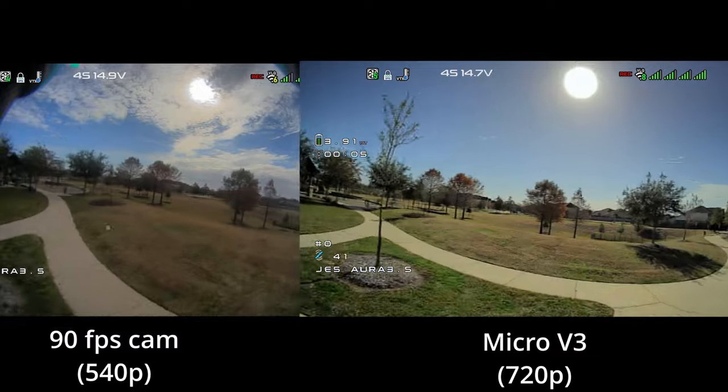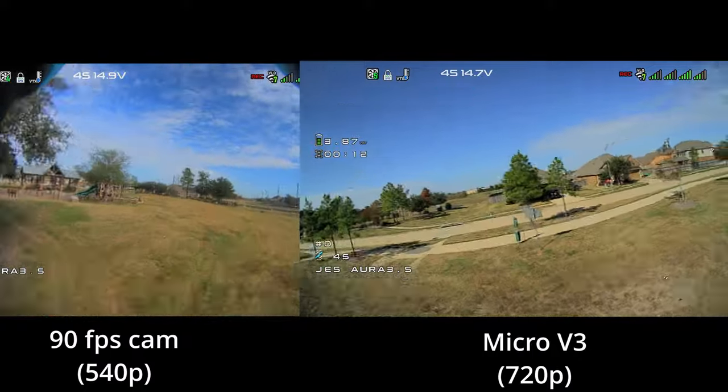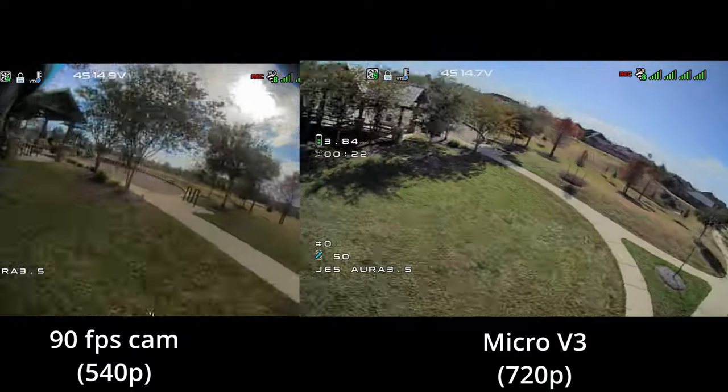There's also the Micro V3 camera, and we're going to compare side by side with the 90 FPS 540 mode compared to this at 720. You can see that the much larger lens compared to that 90 camera is going to get you better sharpness and better colors. The half-inch sensor on here is going to give you better image quality all around. I like to be able to fly at 60 FPS — that's still ultra low latency compared to all of the other systems out on the market, aside from maybe analog. But if you were flying even slower, you could do the new 1080 30 FPS mode to get even more resolution and quality while sacrificing a little bit of that latency.